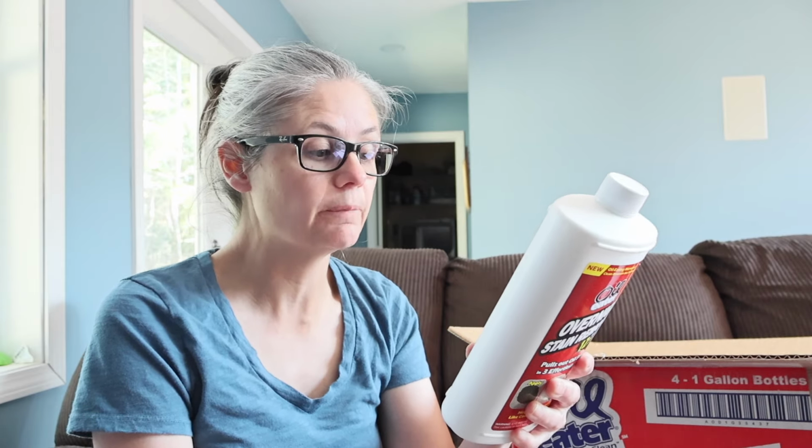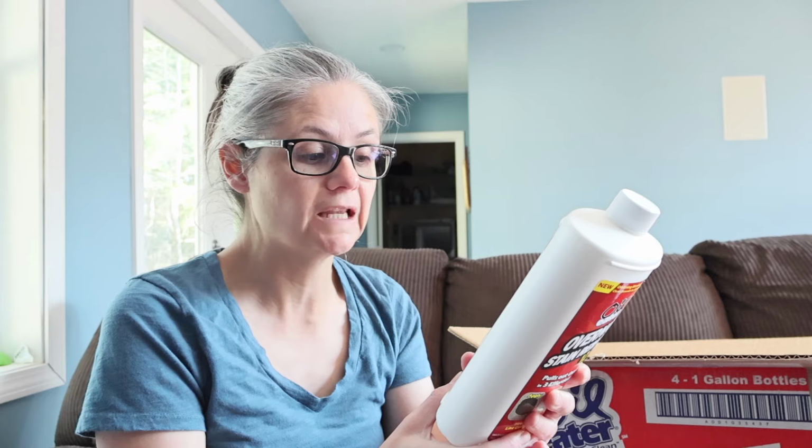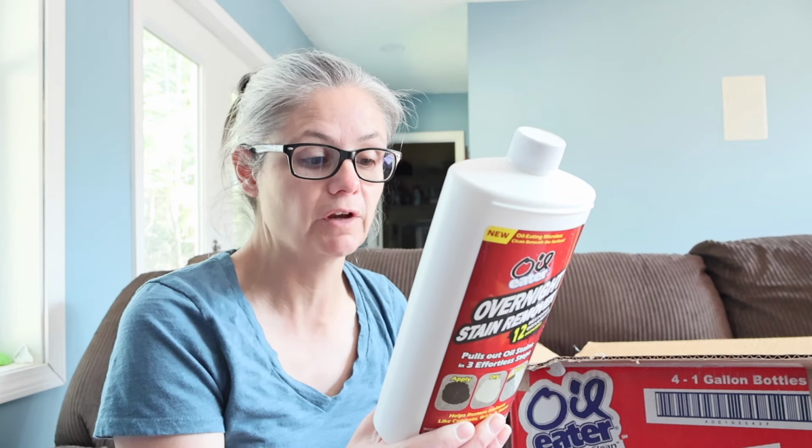That's good to know. So step 1 is to pour the stain remover directly on the stain, starting in the center. Completely cover the stain up to 1 inch around the perimeter of the stain. Step 2 is wait to dry until fully dried into a powder, which is typically about 12 hours. Drying time will vary based on temperature, humidity, and ventilation. And step 3 is brush off the dried powder using a dry, stiff brush. White residue may remain on the surface. Clean residue with firm, dry brushing, then a strong rinsing. If the stain remains or reappears, repeat the steps above. Severe stains may require multiple applications. Note, if a stain has already bonded with the surface, it may not be possible to reverse discoloration completely, but can help improve appearance.